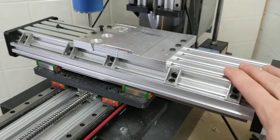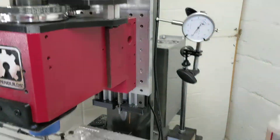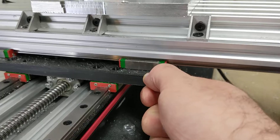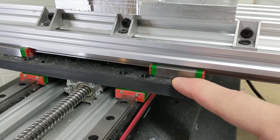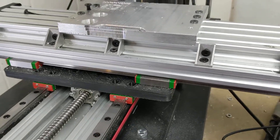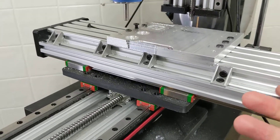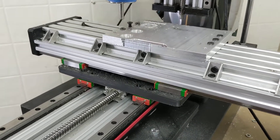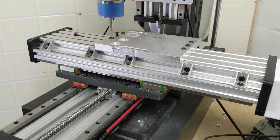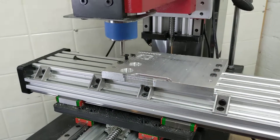Each of these axes — Y, X, and Z — are all identical, so it's generally: make a module, bolt the modules together, hook up your stepper motor, and it's ready to run. From the Y-axis, we bolt the X-axis to a subplate which is just 3D printed right now. I'm using PETG, which isn't even the most rigid 3D printing plastic available, with quick plans to swap it out for aluminum. I'm testing the rigidity of the plastic configuration and plan on comparing the spring force between the plastic and aluminum versions. It does move with plastic — there are two plastic parts in the rigidity chain before you get to the part being milled, which is suboptimal.